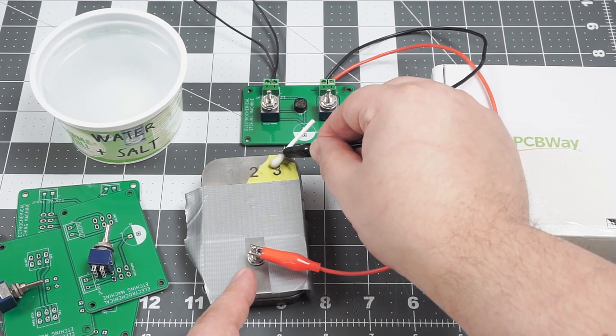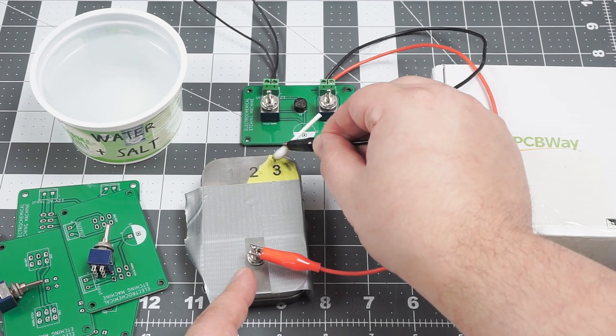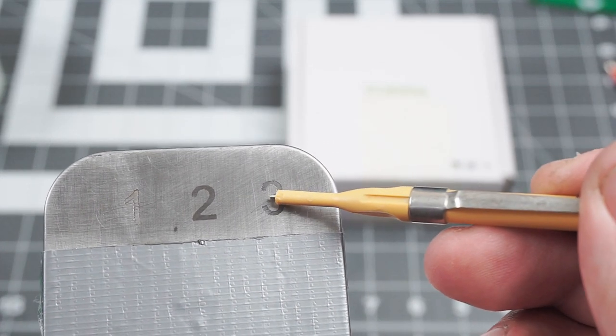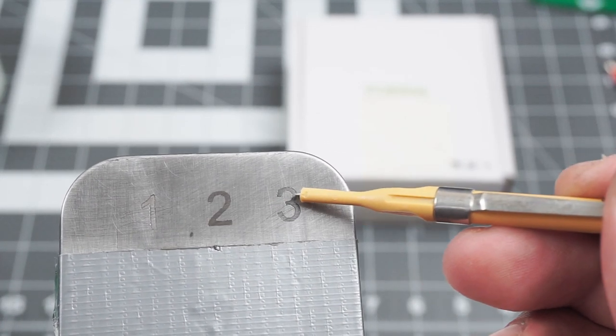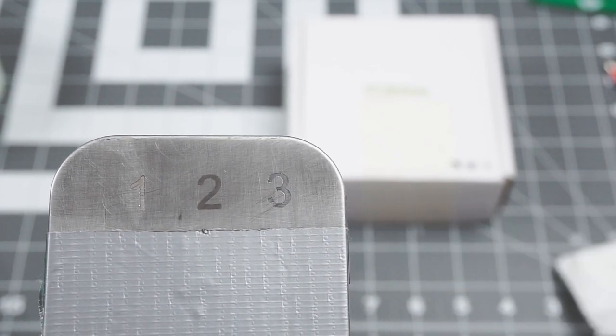The end result should be durable markings, which are just about as detailed as the mask you are able to create. The color produced by the marking process depends on the material and electrolyte. The speed of the etching or marking is affected also by the power supply.